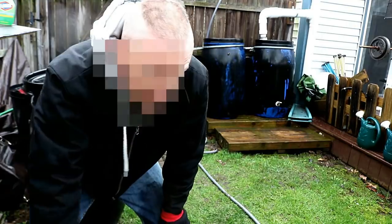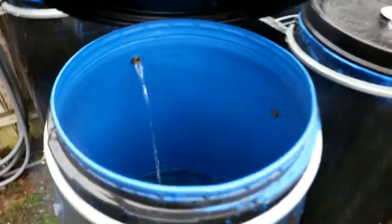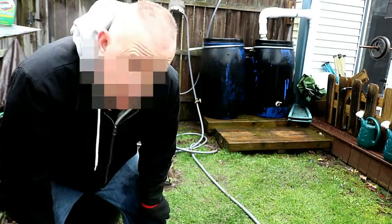You can see they fit together really simply — just a couple inches of cut-up hose in between each one. I've had people ask me why I don't put them down on the lower end where they all fill up at once. This works great for me: that first barrel fills up and once it reaches the top, it hits the hose and fills up the next level, then feeds into the next barrel and then to the fourth barrel. Each barrel fills up fully before it fills up the next one. One of the reasons I like that is the dirtiest water ends up in that very first barrel, and then I've got three barrels of pretty clean water with very little algae or particles in it.